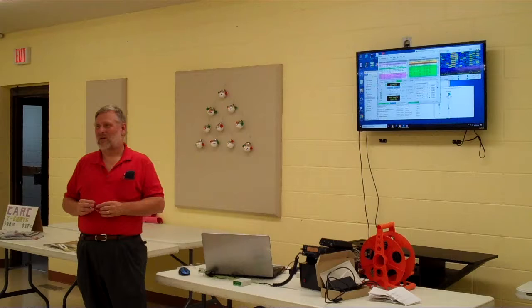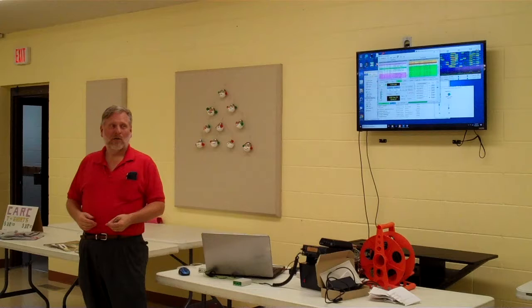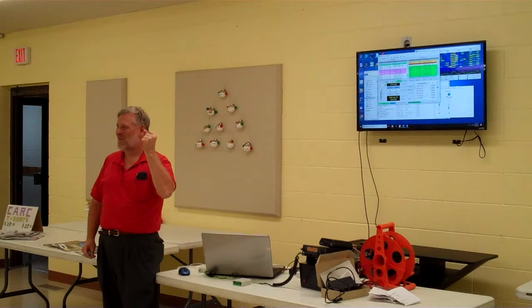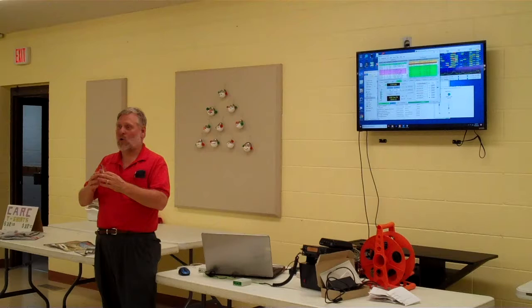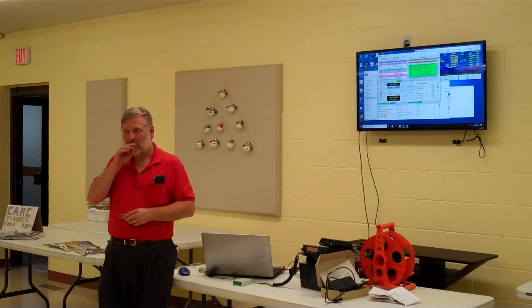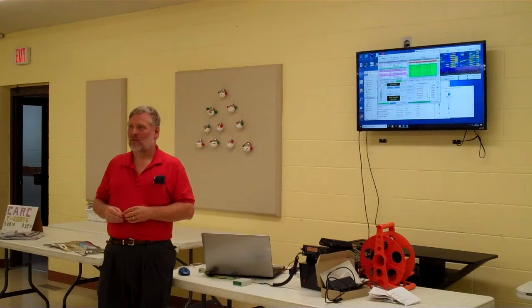It's a wide mode. So I'm watching this radiogram come through, and I'm seeing all these radio teletype signals just smearing this message, and it looks like, oh, this ain't going to decode. And it just popped that radiogram right up as if those RTTY signals weren't even there. They were literally overloading the signal, the digital signals. MT63 can lose a quarter of the copy, up to a quarter, and still decode.